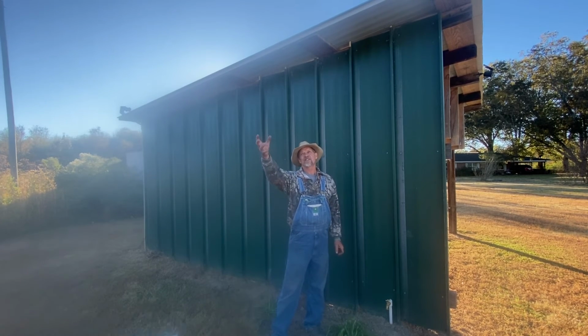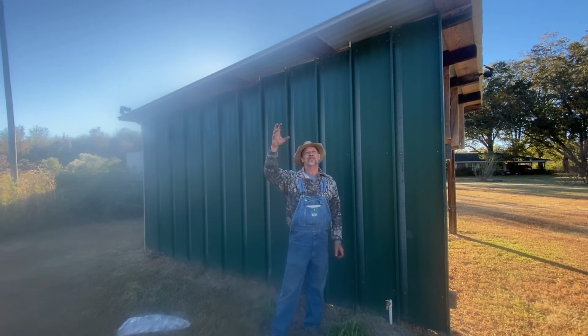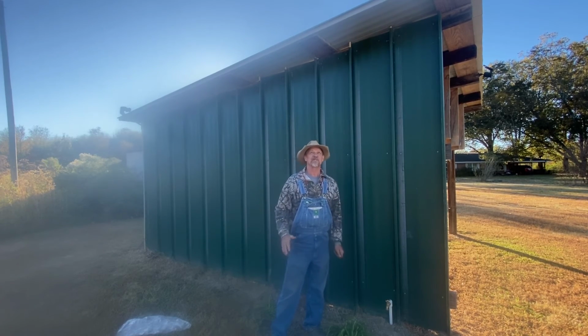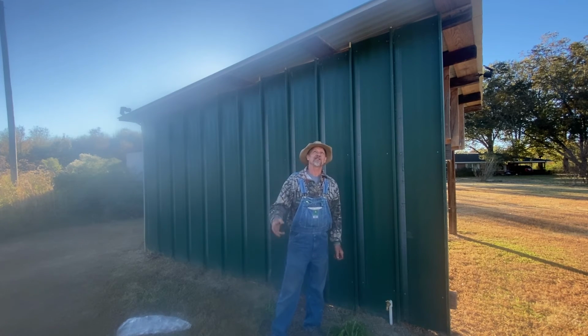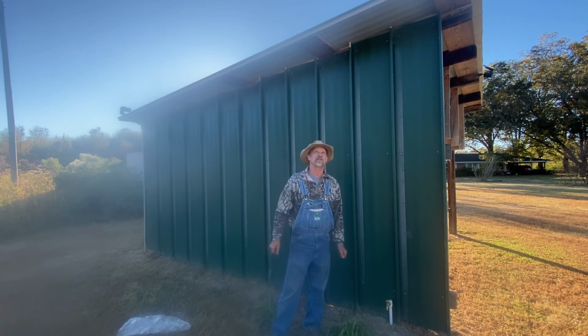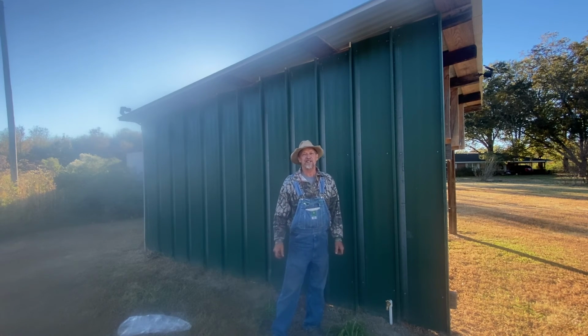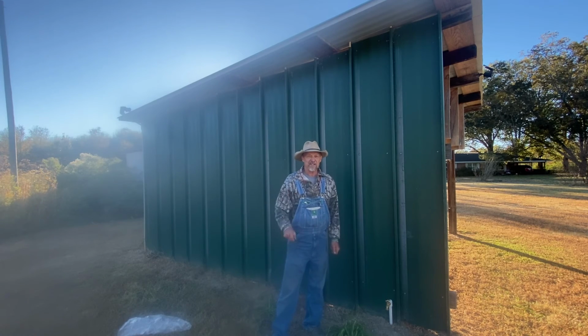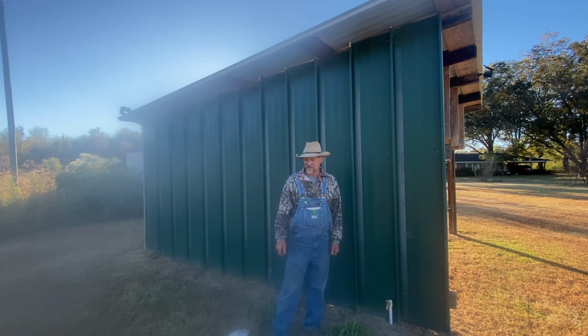And the way the sun comes up, especially this time of year, and goes down in the evening, I needed to tilt that thing all the way backwards. So it's pointed back against the pole, which it's gonna get enough sunlight, because once the time of the year changes, the sun changes more to the east, to the west, so it's gonna be coming right over the top of it. So it should get plenty of electricity to keep it charged. But I'm gonna come back by tonight, play with it, and show y'all how bright it is.